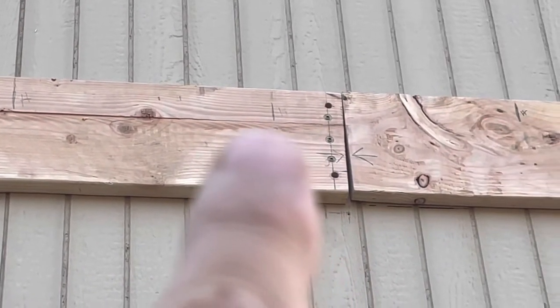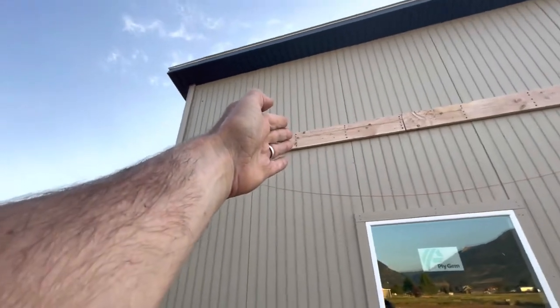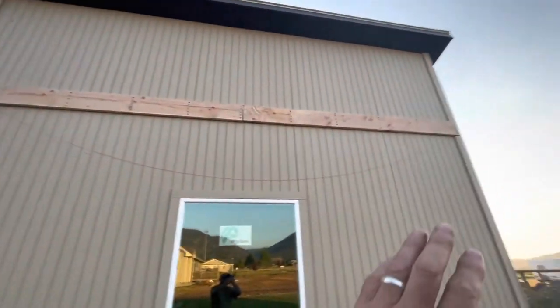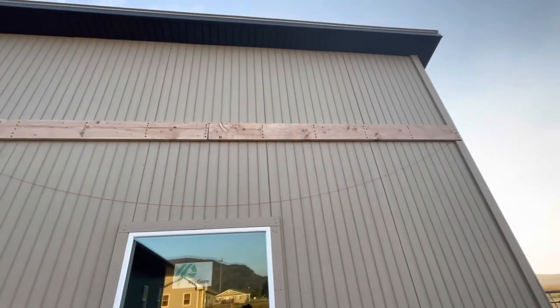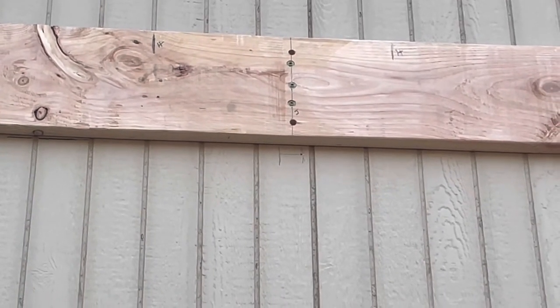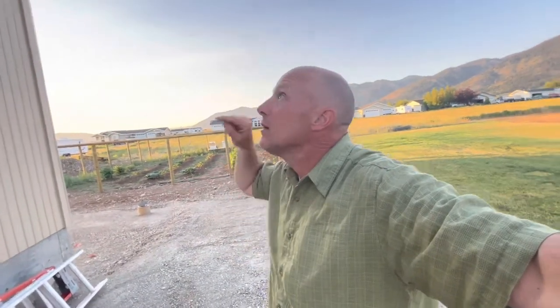The line marked with an H is the rafter - I put 'header' but it's the rafter coming off that'll be sitting on these poles. I then drilled all the holes while the boards were laying on the ground and cinched them up into place with three heavy duty screws. The top and bottom holes are going to be half-inch bolts about eight to nine inches long, going into the trusses.